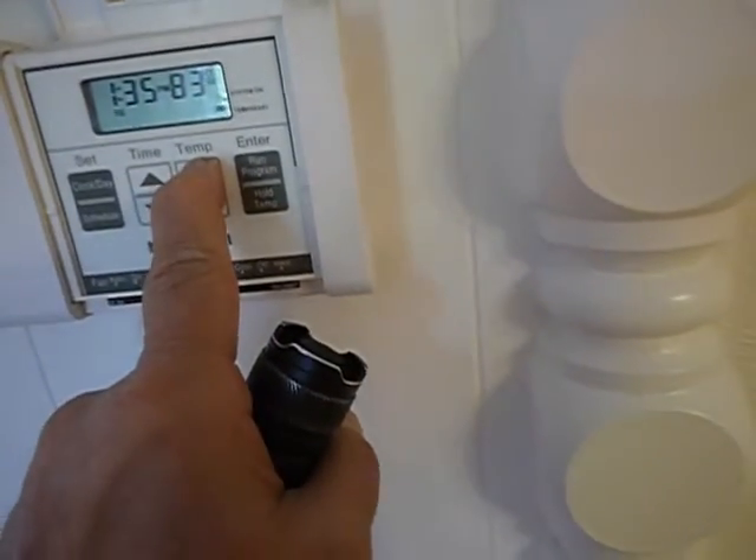Let's turn it over to heat — I've jacked the temperature up nice and high. I'm going to run it a little bit and do a carbon monoxide check, depending on what the flame looks like. Your air filter is 16 by 25 by 1 — I already took it out and it's clean. The flame looks pretty good but had a little rough start. There's some lifting off on that end — lifting off means those little flares, the little dots of orange.